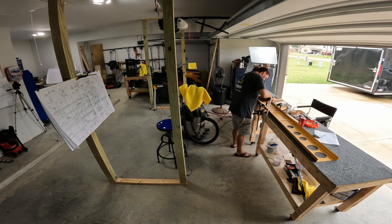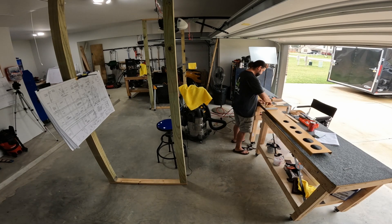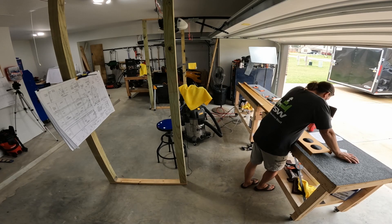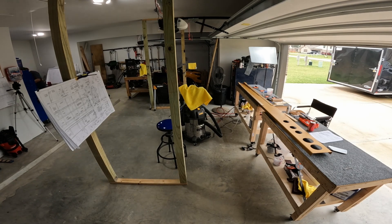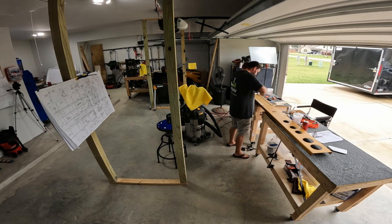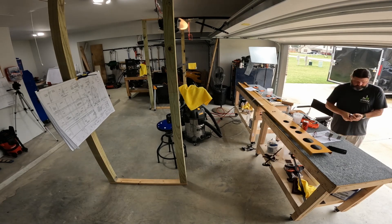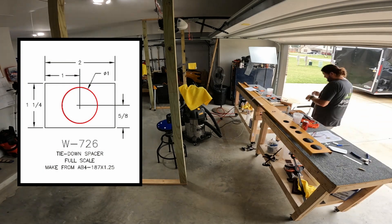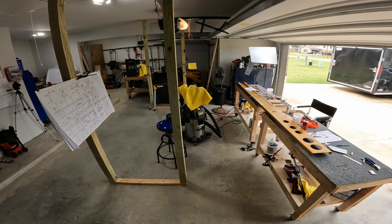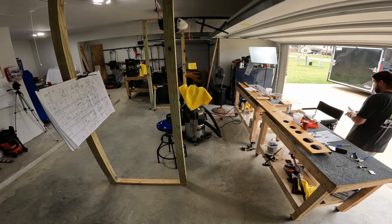It's slow, messy work drilling through all of that material. It worked out with the butyl holding things in place, but I did have to remake one of the four spacers per spar because during drilling it twisted out of position and the second hole ended up too close to the edge. It wasn't too difficult to remake. I'll also admit I didn't drill the lightning hole in the middle of the spacer, so my plane will be about three-quarters of an ounce heavier than someone who did.